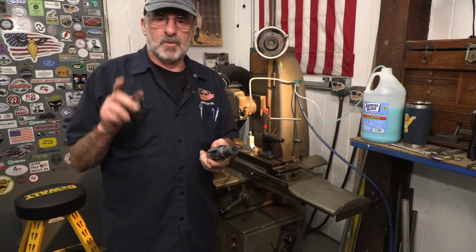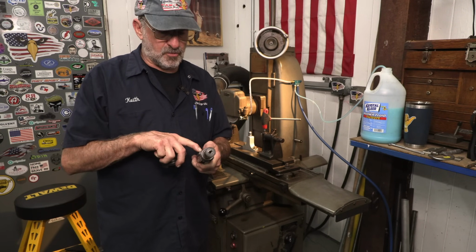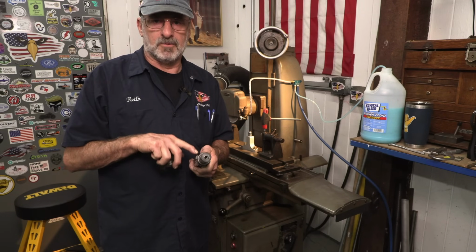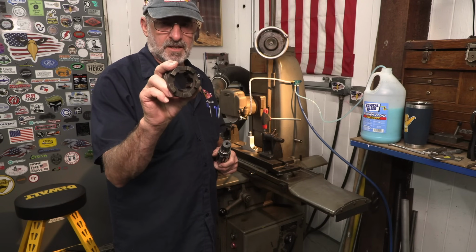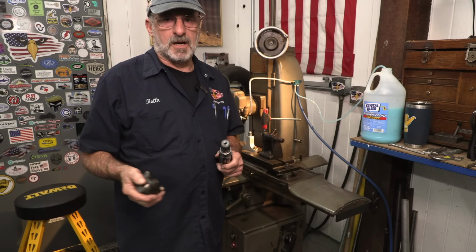All right. We're going to take the other shaft and, while we're in this mode, we're going to grind the root of the other to this diameter. We're happy with this diameter. It's a couple under the bore of this, and it's 1.5 over the stock shaft.